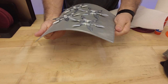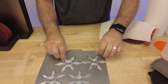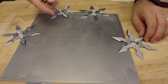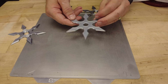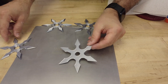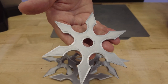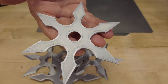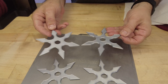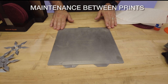The flex won't move purge lines or thin brims because they're just too thin - they'll flex with it - but the solid parts will pop off. So I'm just going to flex in a couple of directions. Okay, these are off. We can see on the plate the outline from the oils of the filament bleeding through - that's what we're going to be cleaning off. And you can see how gorgeous the backs are - you're not going to see those scratch lines from the scuffing, it's still shiny. There's no remnant of the scuff lines, so anybody worried about that - you still get a shiny, beautiful bottom on your prints.